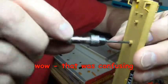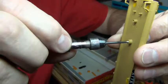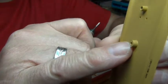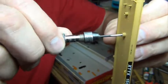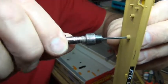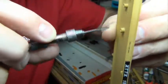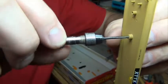You've got to make sure you hold it square to the part - this direction as well as square this direction. So I do it by hand. You just got to keep an eye on it and go real slow. Turn in a couple of turns, then bring it back out. It gets the little pieces it's cutting on the end. It's going to raise a little bump on the edge as you're tapping it out. Turn the threads in - you find them just like turning a screw in after you get started. You have to feel for the threads. Take it in a few more turns and then bring it back out.